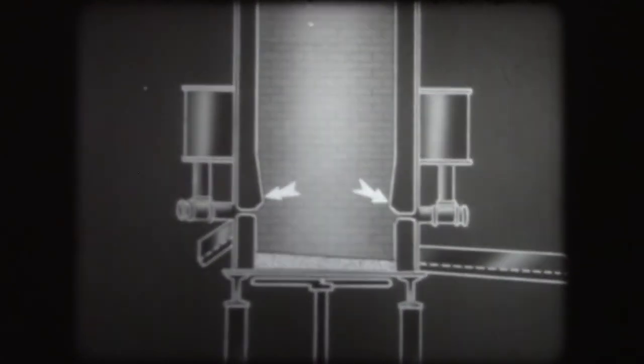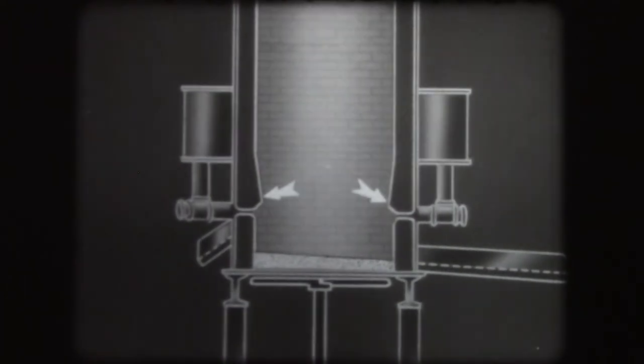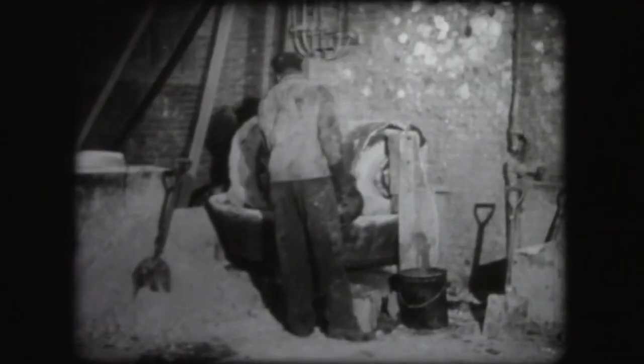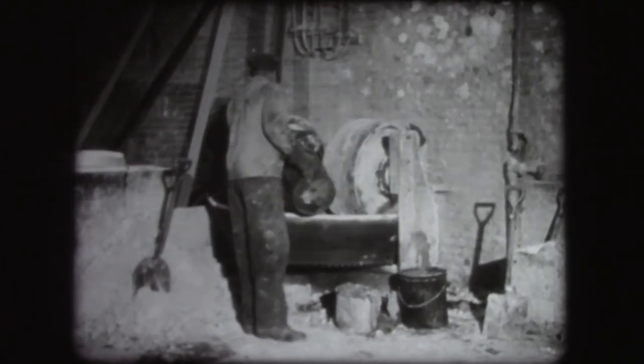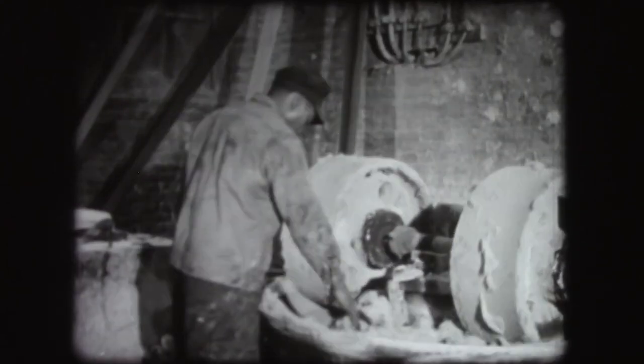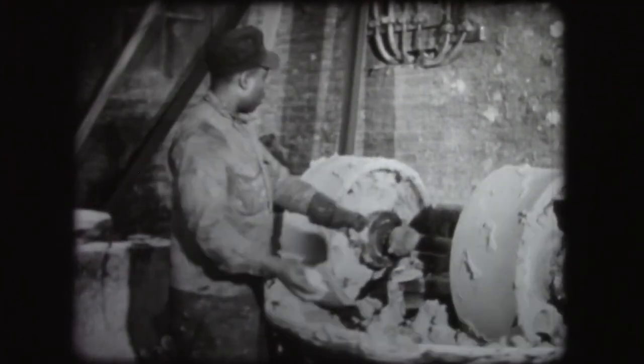Notice that the lining is not perpendicular throughout, but slopes away from the tuyeres to allow slag to flow over them instead of into them. For the repair of the lining, a daubing mixture is used, and this is made up either by machine or by hand. Here a machine is mixing proper proportions of fire clay, sand, and water. Exact proportions may vary depending on the materials used. Be sure the mixture is not too wet — it should make a firm ball when rolled and should hold firmly when thrown against a wall.